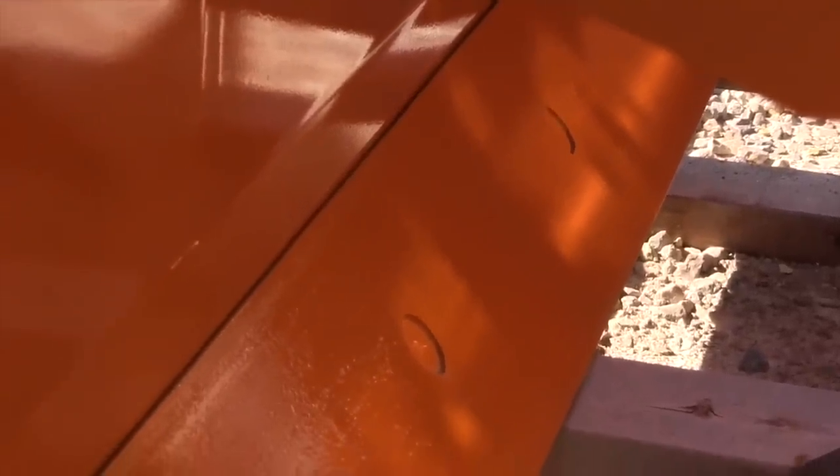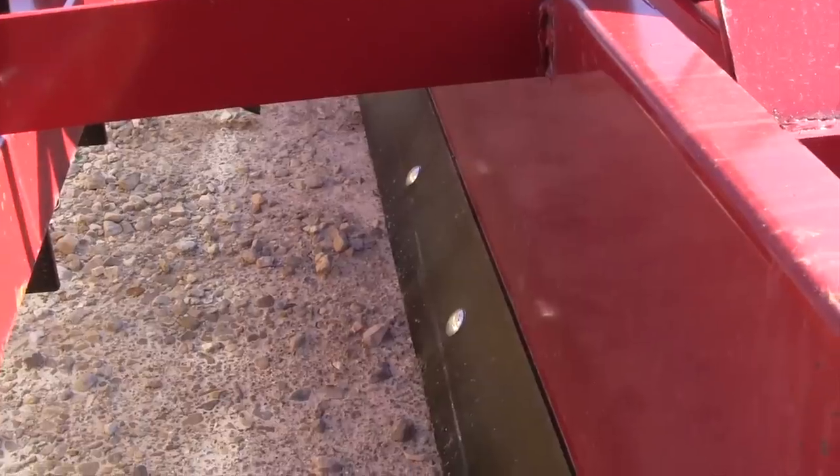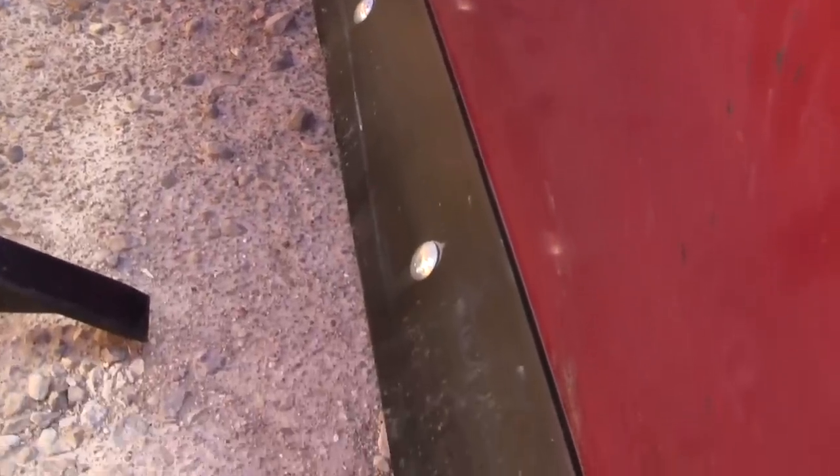The next thing to look for is the cutting edge. Good box blades have a really heavy, replaceable cutting edge both on the front and the back, so you can cut into your driveway going forward and also go in reverse to push that gravel back. If you're seeing a big difference in price between box blades, the cutting edge may be better on the more expensive one. You kind of get what you pay for — heavier construction, better welds, thicker and higher quality metal will be more expensive. I've personally witnessed cheaper box blades being torn up, and if you bend something and have to pay a machine shop to re-weld it, you'd have been money ahead getting the better quality one in the first place.